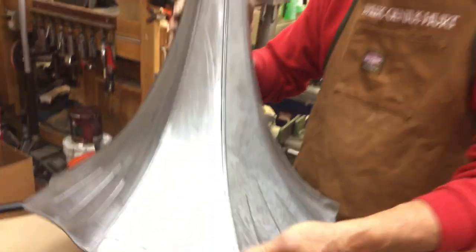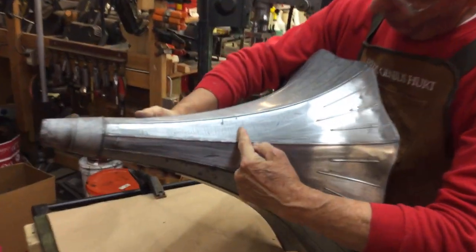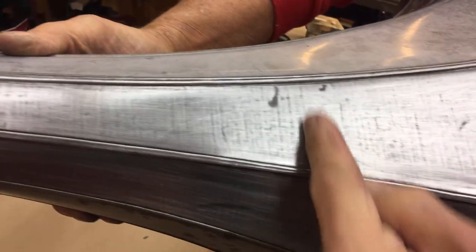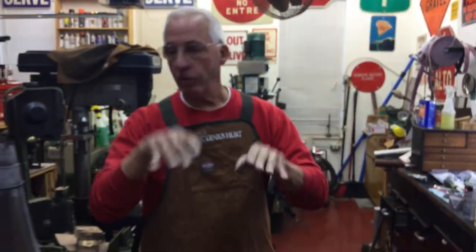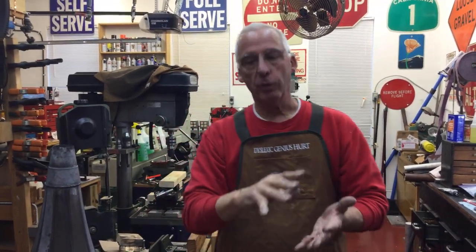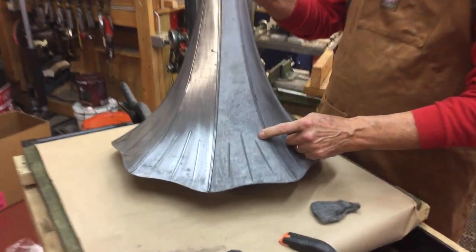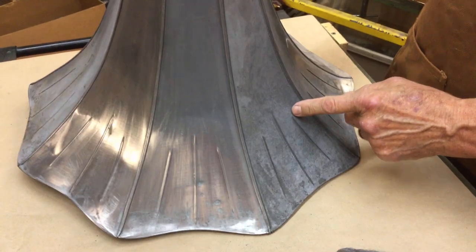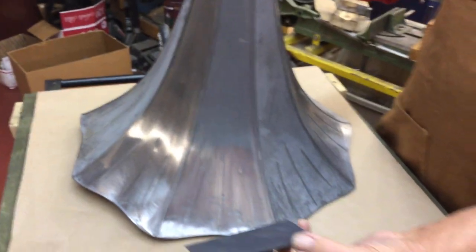What you want to do — I'm going to point out a few things about the horn. You see these lines going this way? It's rough right here. That's because this is sheet metal work and when they're bending it in the sheet metal machine, it gets that serration in it from the rollers, and that's normal to it. What you want to first do, you're going to start with a panel like this and clean it down — you can see the serrations — with 320 grit sandpaper.